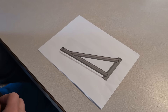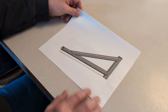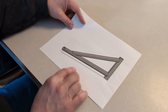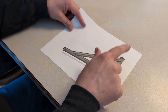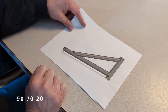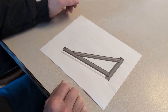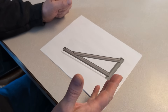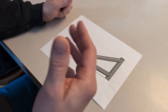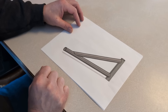We've got the rotary axis assembled and mounted on the plasma cutter. For this first sample project we drew up three tubes - we've got a shallow notch here and two other notches at 90 degrees and the opposite of that. One thing about this job is it's sequenced, so it's going to cut all three tubes at one time. We're not going to set up one tube and then reset for the second - all three are sequenced on the machine.